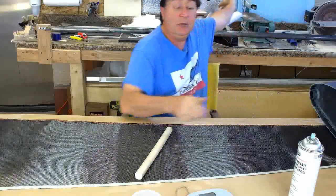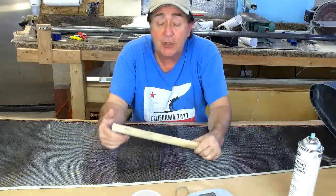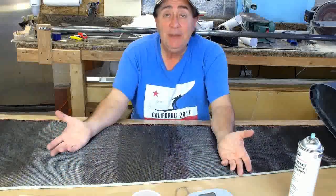This allows you to tailor the wall thickness while you lay up the tubing, instead of laying up say two layers and then coming in later to put on local reinforcements. A little imagination, a little mathematics, and you can create custom tubing. And you're saying, what's the big deal?